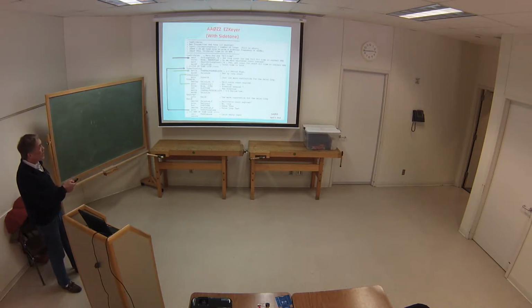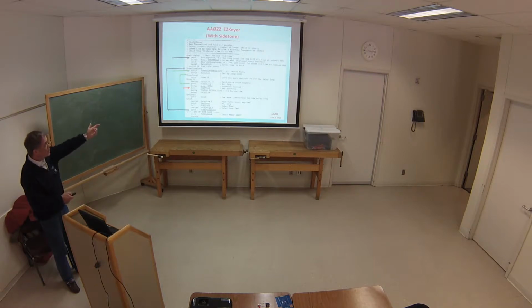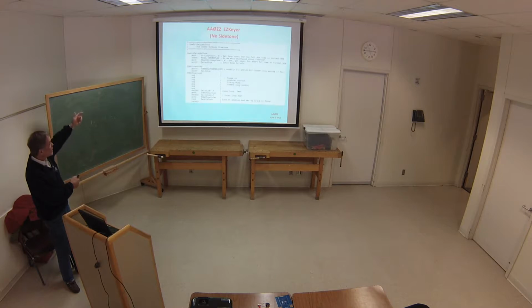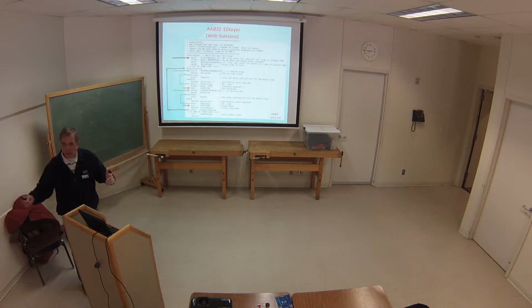Basically I'm taking it for a half period, and I'm going back and forth for this length of time. And then finally I turn the tone on, and then I do a similar loop. And then I go back to the top again, so it does that over and over again. That makes it 600 microseconds, and you loop the whole thing for a certain number of loops, and that makes your dit the right length at 600 hertz. So it looks more complicated, but it's not too bad an algorithm.